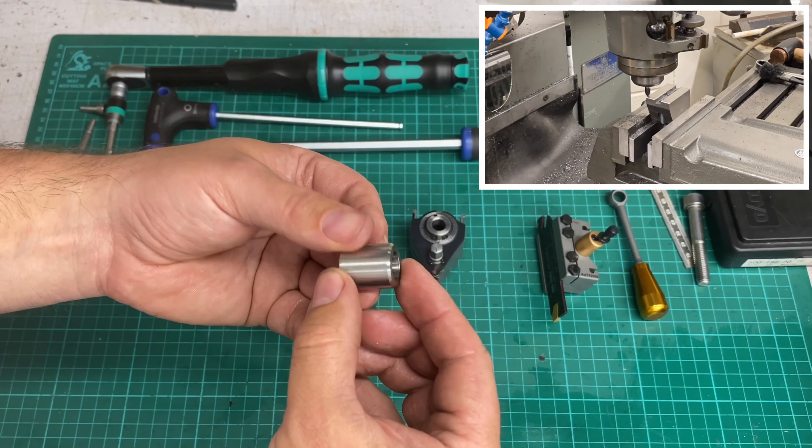This part here that I mentioned already is chamfered top and bottom so that it clears any corner radii from any tooling. Prior to putting all this together I gave this a good stoning - just to make sure that there were no burrs anywhere. I stoned the edges here just so that there weren't any bruised areas, all of the edges, all of the corners - anywhere that if there was a small burr it could cause it to hang up and then it's not a nice fit when it goes back together.